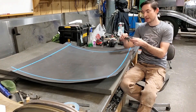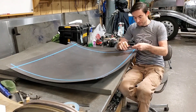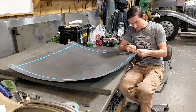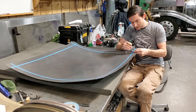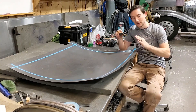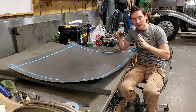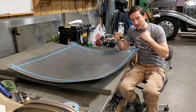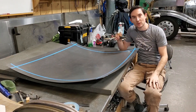So I've got my calipers set at 1.306. The easiest way I've found is to just make a little scribe mark every half inch or so all the way around, then connect those dots with tape. That way I can make sure the tape is a nice straight line, not varying, and I can scribe right on the edge of the tape and trim out the panel.